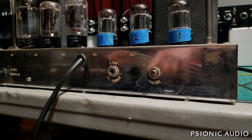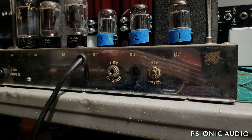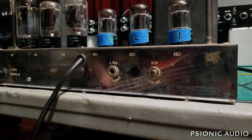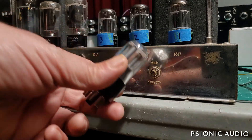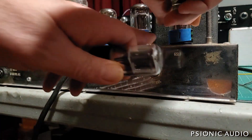That takes care of that. Now I've got these Sylvanias numbered one, two, three to find out where the quietest positions are. There's a little bit of ring from tubes and stuff on the bench that are vibrating. This was also a good opportunity to try out this other Sylvania 6SL7 — that's in the '49 Epiphone, where I was concerned the amp just did not have enough gain. So we're going to put this in V1 first.